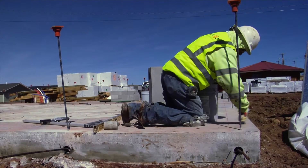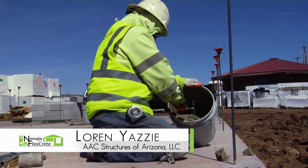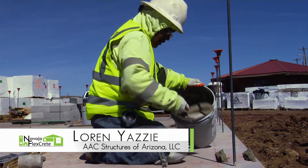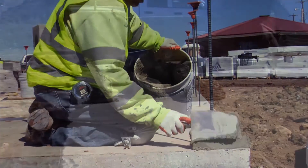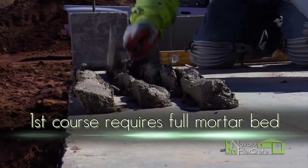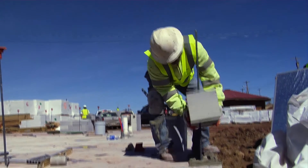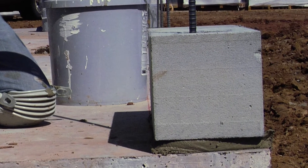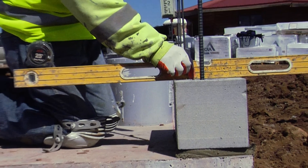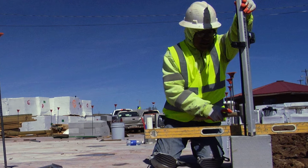Just take off a little bit of debris. Set your bed mortar on the inside of your line and the edge of the house or the slab. Slide it over your rebars and then sit it on top of your bed mortar according to your lines and the slab. Then get your laser and your level — the laser is level across this way, then laser this in. Start tapping it down until it tells you it's right there.